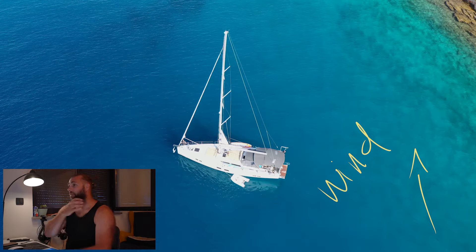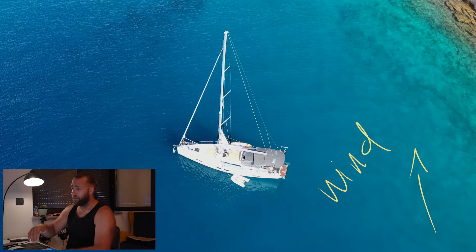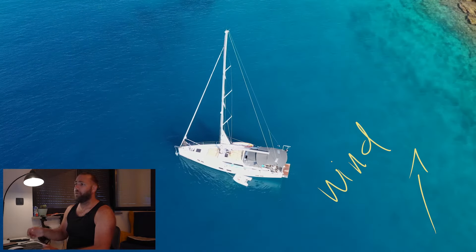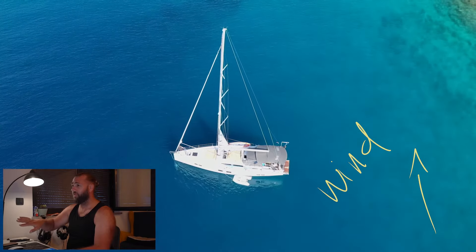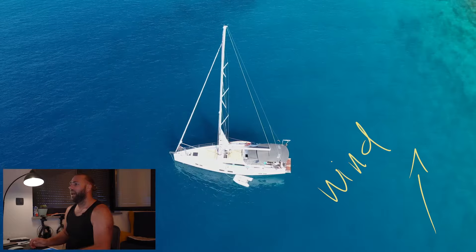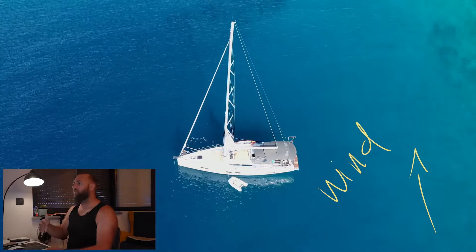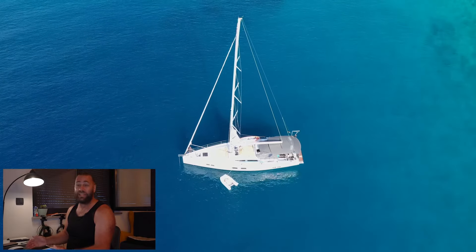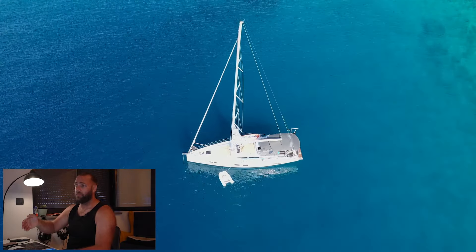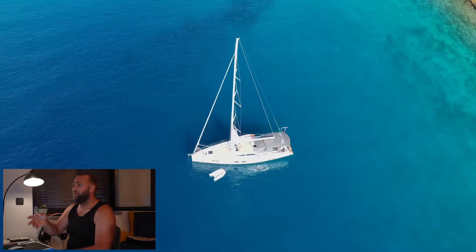Mahina's about to drop the anchor. We're in 15 meters right now, so I say I want 15 meters down to get it on the ground — she starts lowering. I'm still moving forward slightly but I've just gone into reverse and starting to get my line set up. You can do this with or without bow thrusters — you use what you've got. I've got bow thrusters on this boat so I use them because it's easy, but you don't need them for this maneuver.